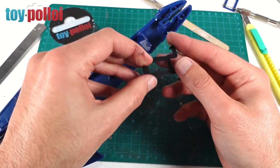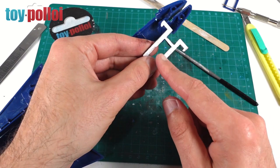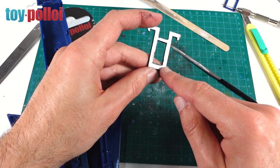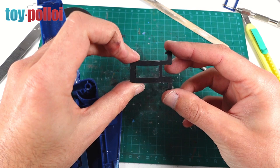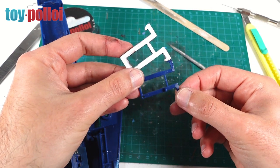And then I also want to put in these extra bits of support. So I'm going to stick another bar across this on the underside. On the top side, I've got to make these two panels. And before I remove the sticker, I need to drill some holes where these two little markings are. So I'm going to do that and then add the extra pieces on, and we'll have something that should work, because it will basically be a copy of this piece, but it'll be a bit stronger.